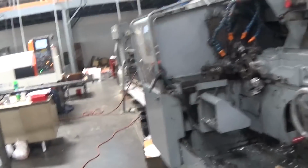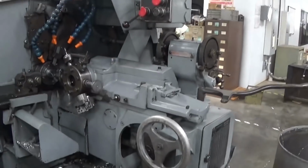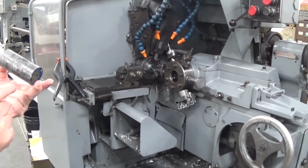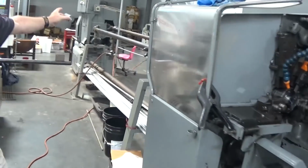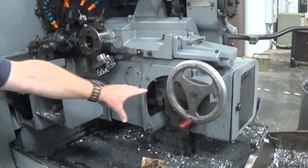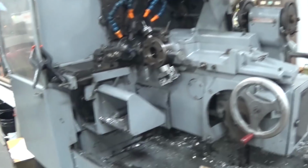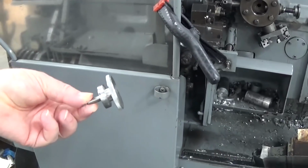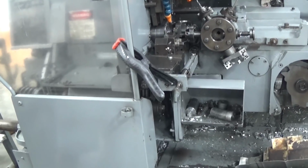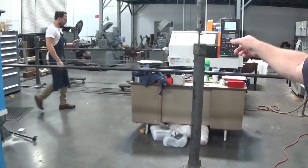We have a couple of machines here. These are our newest lathes. They're column fed. They got set up in November, but they're right next to this old Brown & Sharpe 2-inch screw machine. This is pre-World War II. We produce our 1 5/8 inch hand wheels, our smallest hand wheel, on this machine. Long material gets fed through this column into here. This cam down here rotates and tells which tool is in position and for how long it's going to run. And then it gets parted off and drops into a bin to make this. Nice. And then this will go off for a second operation on one of the mills, to get the hole put in for the little hand knob and a recess put on it. Very similar machines, just more modern.